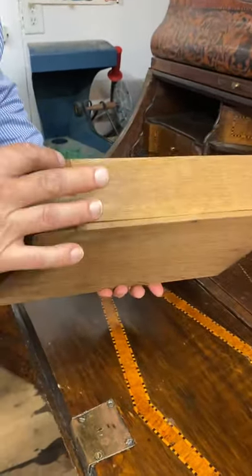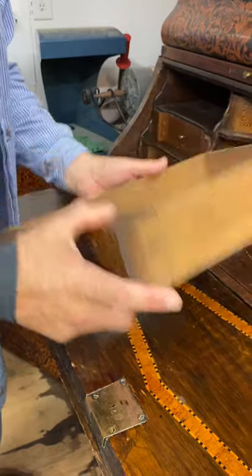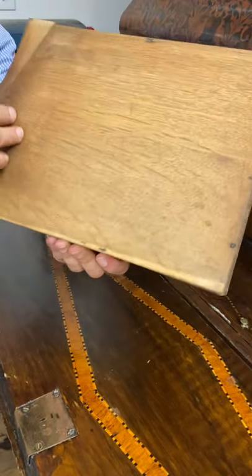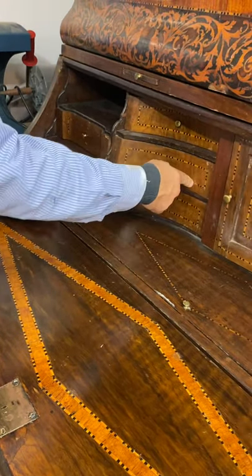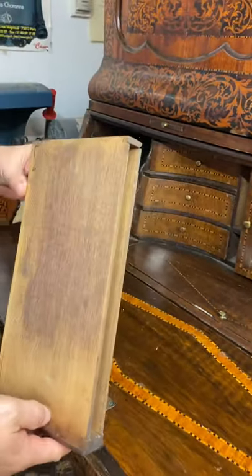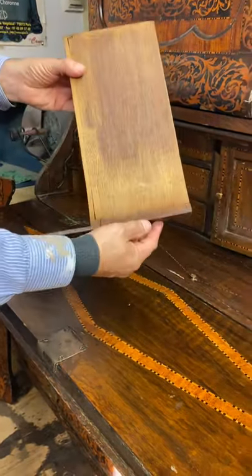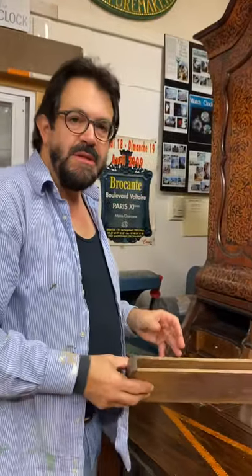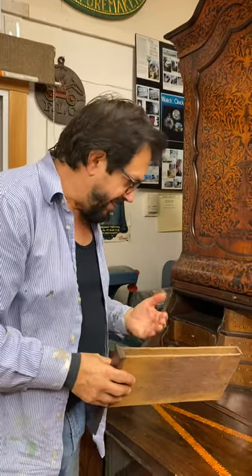So massive. This is reminiscent of not being a total period piece, I believe. These dovetails are nice but they're huge. Inside we have English quartered oak — beautiful oak. Most of that oak came from England, even though these pieces were made in Holland or Amsterdam. Here are our document drawers — these are part of our secret drawer affair. You want to put documents and cash in there. Just take a look at the dovetails putting this box together. Not everybody created very fine dovetails like the English and the French. I would say the English have it on the French — the tiniest, most radical angle of the dovetails.